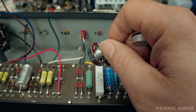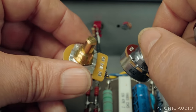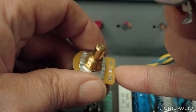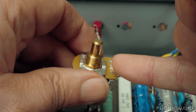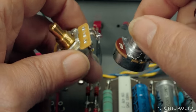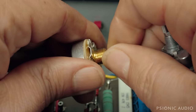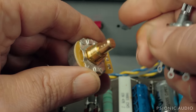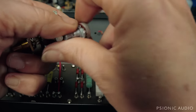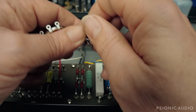I find that it does matter a lot when it comes to guitar amps. In certain points of certain amps, like a Fender with the volume and the treble pot, you'd want to use a J taper, not an A taper. And in some guitars — this is one from a Telecaster — you might want to use a 10% or a 30% or some variation thereof, especially with a guitar. This is a low torque one. The stiffness and the feel is radically different between this low torque CTS and this little 16mm alpha, even though they would function the same in an instrument.